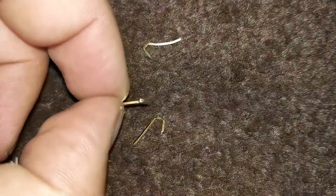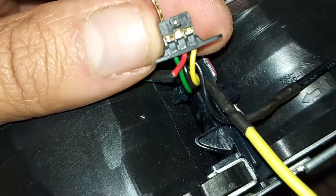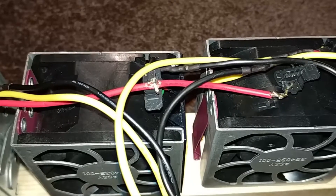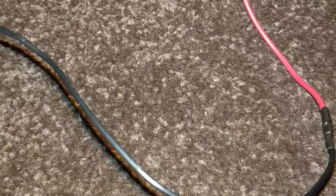I've been cutting metal bits off a hard drive connector — these will sit in the PWM connector on the fan, and then I can solder the red wire which leads to the motherboard. I've connected all the PWM lines to the red cable on all six fans, which then goes to a black cable and then the blue cable on the fan socket. I added the black cable to get a bit more length.